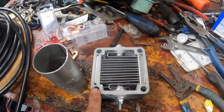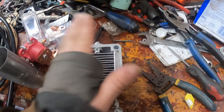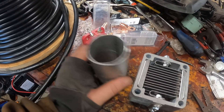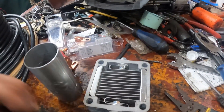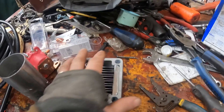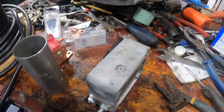The real first step is going to be to cut two pieces of plate for the top and bottom. I really wanted to do this out of aluminum, but I couldn't get aluminum, so it's going to be out of steel. I've got my little mill, but I'll probably just weld this on, drill it out with the biggest drill I've got, and then take a die grinder and open it up. I think I'm going to use eighth inch plate because I have some.